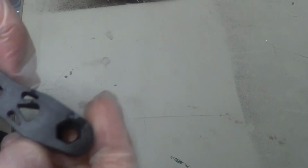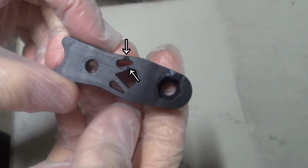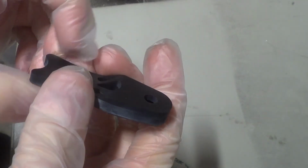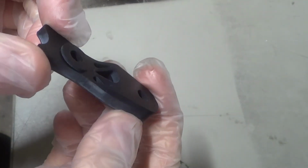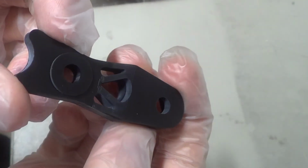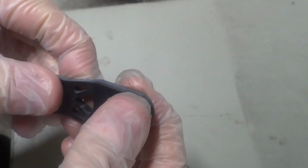There seem to be a few places where the print did not stick properly to the plate. I will probably increase the exposure time for the bottom layers before the next print. Some slight discoloration on the sides. It is possible to see the layers in the radii of the slope, even though I printed this with a layer height of 50 micron.